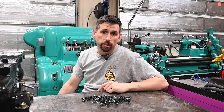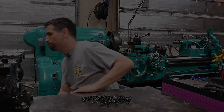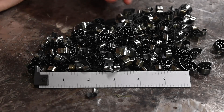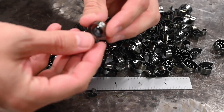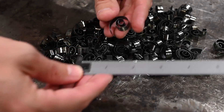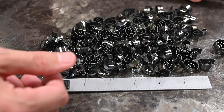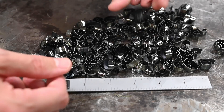I'm going to show you what I did in the pre-video testing. Here are some of the chips I made with the Monarch — about a week and a half ago, just messing around and seeing what kind of big cuts we could take with it. I think where I ended up was about 200 thou on the dial, and the chips ended up being about 215 to 220 thou when it's all said and done.